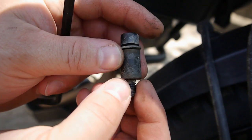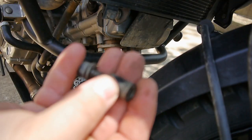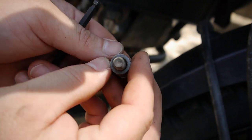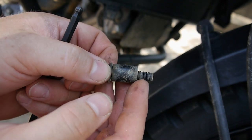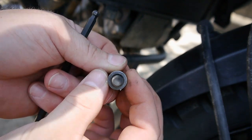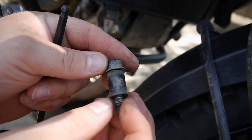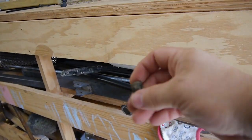So let's do two things. One, let's use the lathe. I'm going to make it maybe a hundred thou longer, and the ID will make it just a hair snugger. You can see how much wiggle room there is. We'll keep the bolt and come back. Let's search through the scrap and see if we can find something close to what we want.